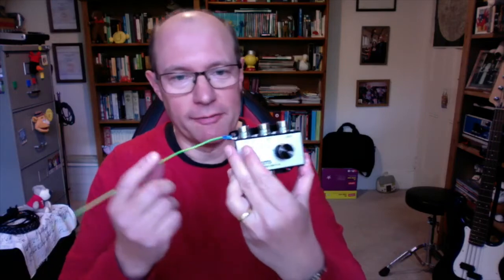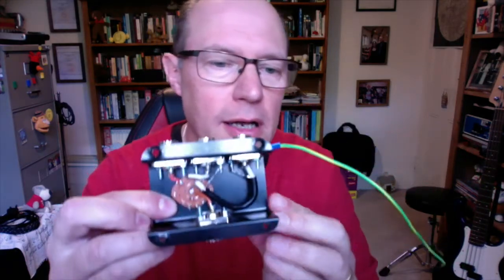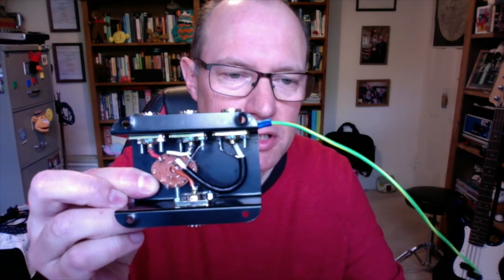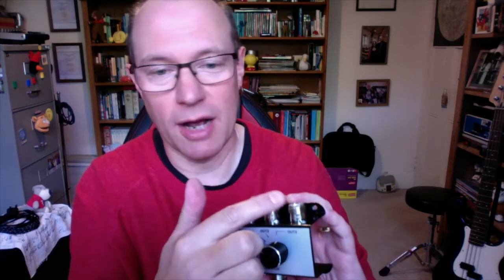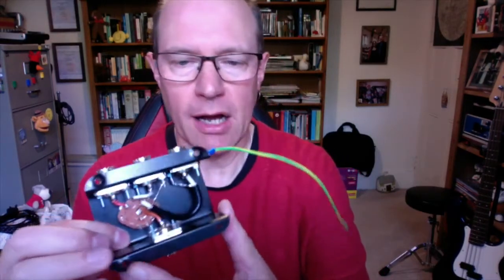Right, the moment of truth — here it is rebuilt. I've got the earth wire for the ground bus, and here we are. I think you'll agree that is much tidier. In the end the only things I kept were the chassis and the switch. I swapped out all the RF connectors — fortunately as a good homebrewer I had a ready supply of chassis-mount SO239s, though I've used them all now and will need to buy more. I also swapped them out because reports online said they weren't quite the right size, causing threading issues with PL-259s.